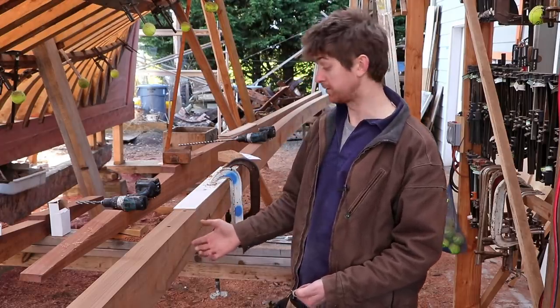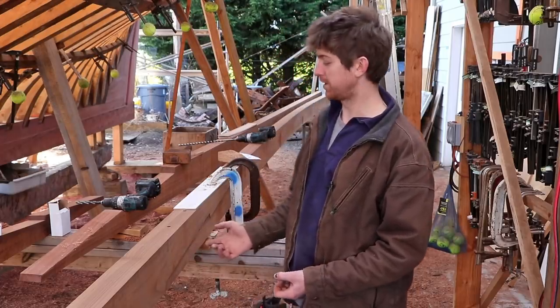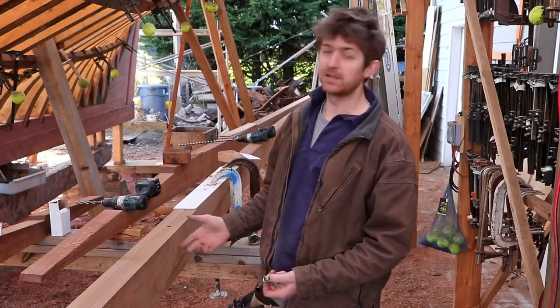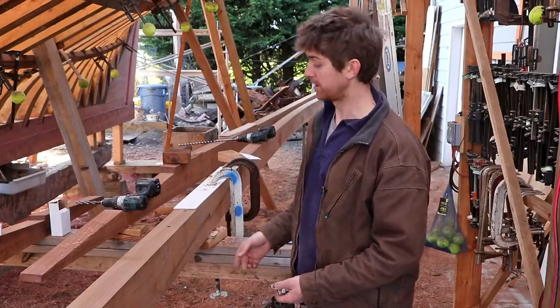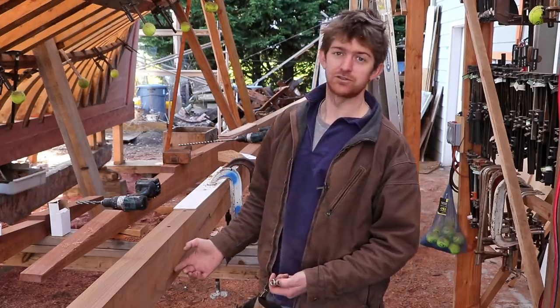So in this case, it's perfectly fine to just leave a joint like this dry. There is actually a school of thought that you don't need to use bedding nearly as much as some of us do, and I know several boat builders who use a lot of dry joints like this.